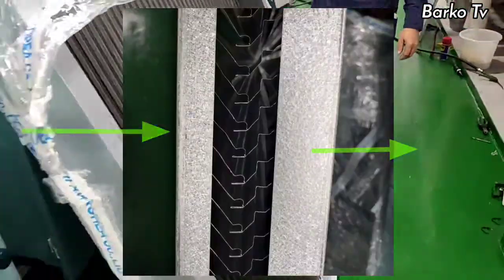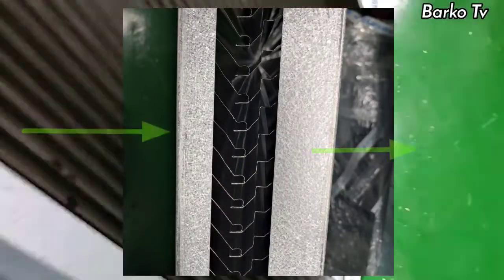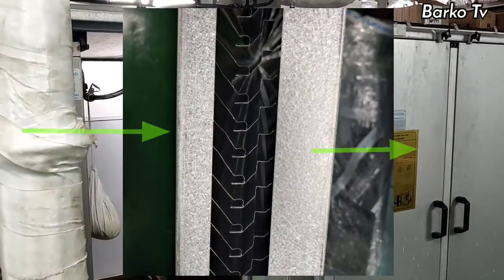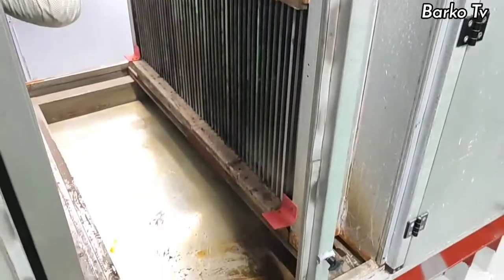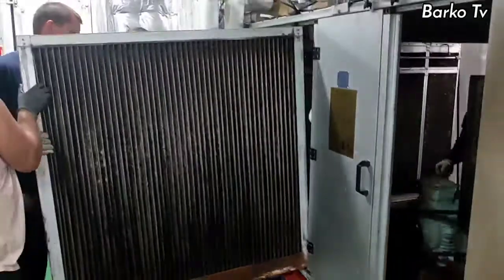This is the view at the top showing the arrow direction, which is the correct flow of air. This unit must be installed in the correct direction to serve its purpose. That is the unique design you can see at the top, where the fins catch the water. Basically, when you see how the fins are bent, you automatically know it will eliminate water before entering the fan compartment section.